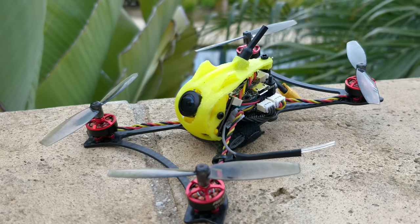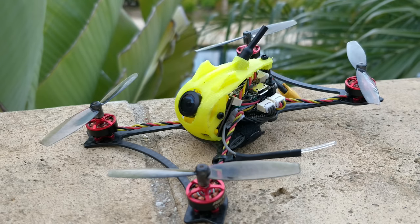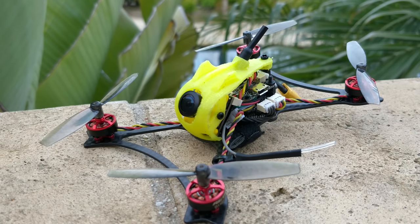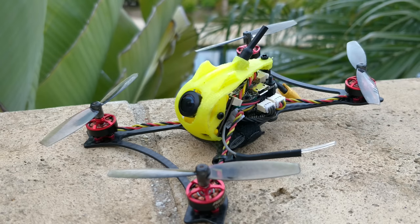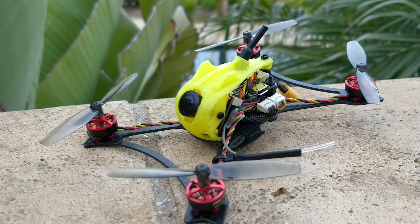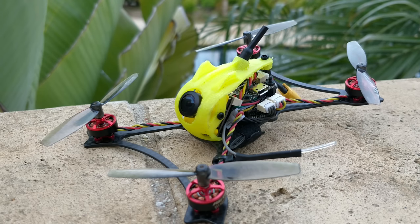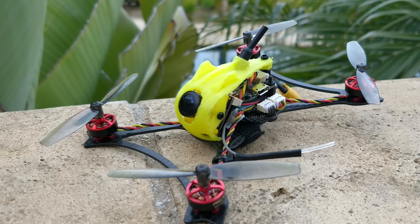The reason I wanted to point this out is because the toothpick design — the actual one that I designed — is going to perform a little bit better than this quad, and I'm going to show you that in the next video. I'm guessing — I don't know for sure, this is purely based on my testing — it's because the whole weight of the quad is more focused in the middle, so the quad has an easier time managing its attitude in the air. When you give it stick inputs, it has an easier time executing.